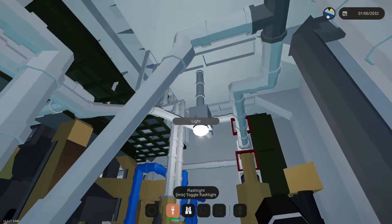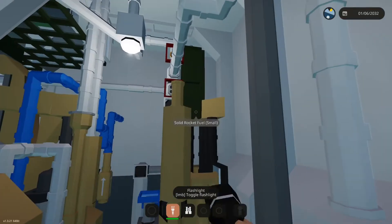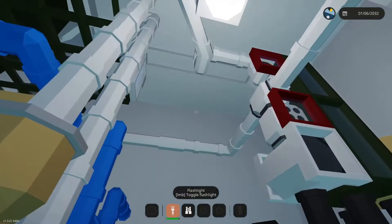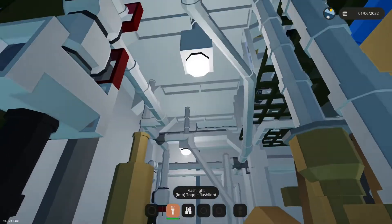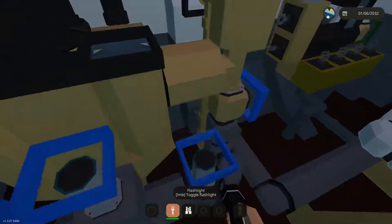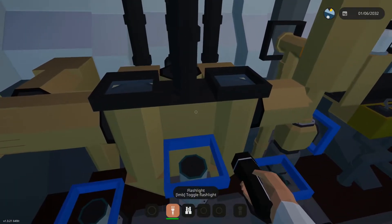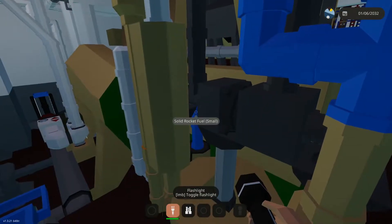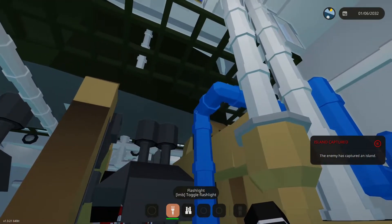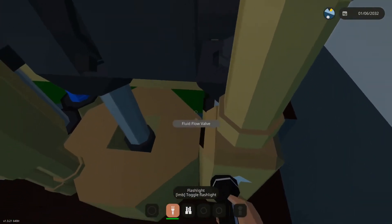Going up to the right side, there would be a storage closet over here for stuff — spare parts, oil, and everything. We're on the starboard side of the ship. We have the condenser here with its circulating pump, and the main service pump over here — so if you want to do any sort of water movement you could do it with this pump. Not too sure what these two pipes feed to — possibly just go out to the ship. Lots of pipes in here. All the steam pipes are connected, with the inlet and outlet going to the condenser of course. You could spend all day going around here finding where all the pipes go. There's still a bunch more pipes to go — lots of empty spaces everywhere that I know have pipes through them, but I just don't have any pictures of them.